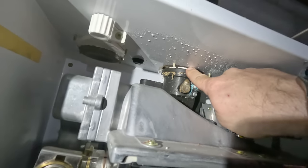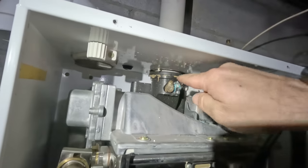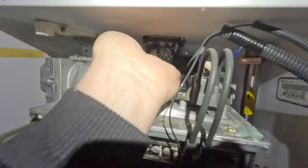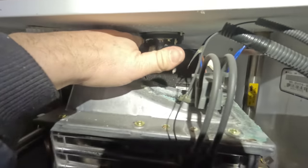There's a little bit of warmth in the radiator. Looking inside, there's a rubber gasket right there that should be up tight, but it's not — it's leaking exhaust fumes in there. That's causing moisture which is causing corrosion and stuff in here, which can cause some issues. That's probably not why it wasn't running, but it definitely ain't right. You can feel the hot gas.